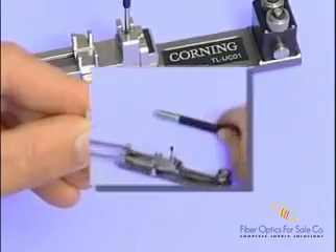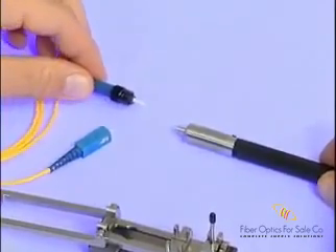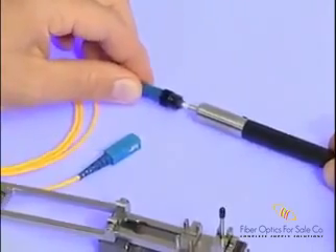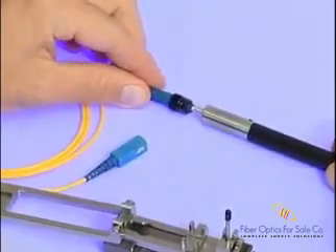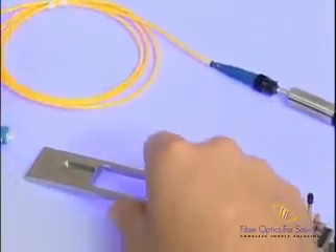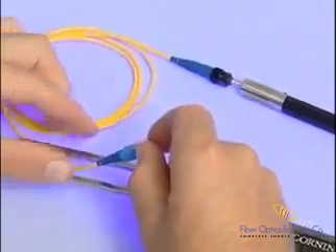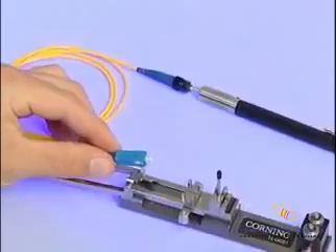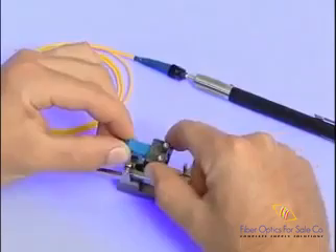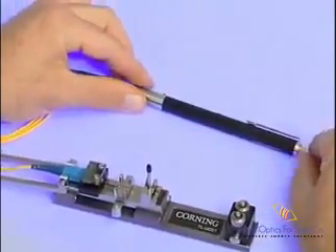When terminating a Unicam connector with the CTS kit, it is necessary to set up the visual fault locator (VFL), jumper, and CTS adapter. Connect the supplied VFL in the tool kit to the ST-compatible side of the supplied SC-to-ST-compatible jumper. Guide the other side of the jumper through the crimp handle and securely insert the SC connector into the side of the supplied SC-CTS adapter labeled VFL.